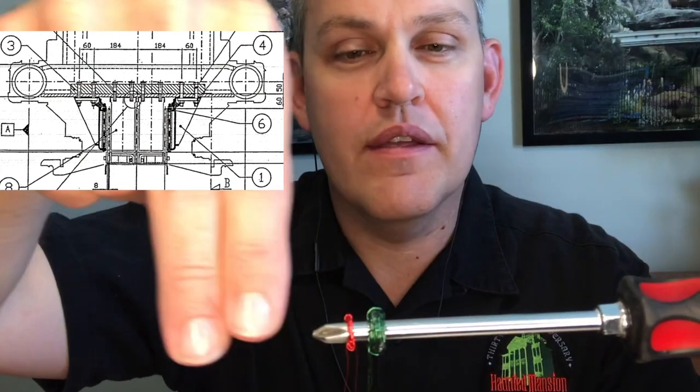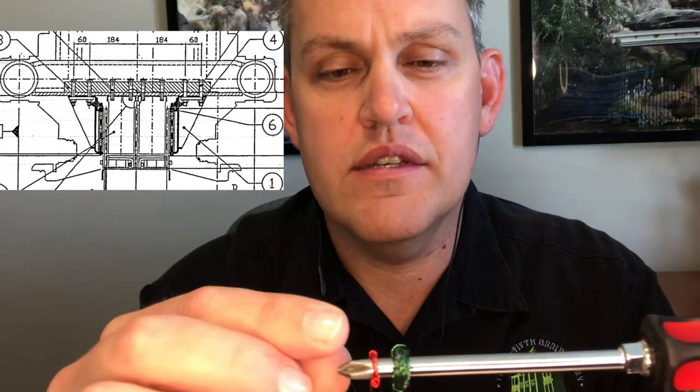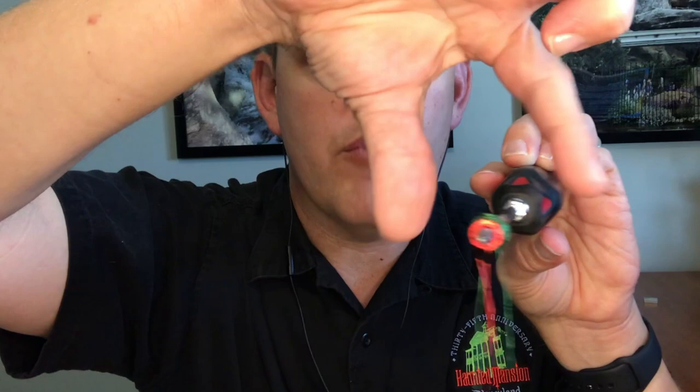But the way this is facing on the track is the train's moving this direction or this direction, either way, and the reactive fins go on the outside of it this way. This iron core has little ripples in it that match all the way up against the outside of that box. And this electromagnetic force is generated outward, away from the coils like that.